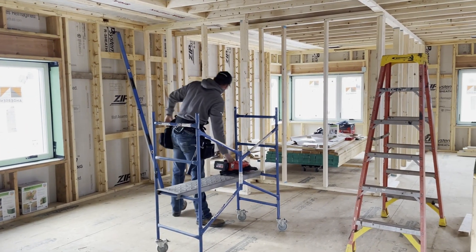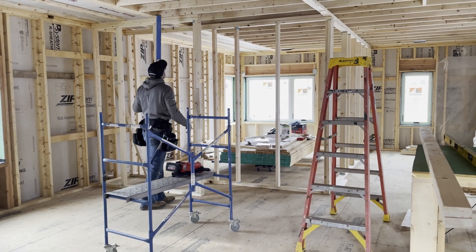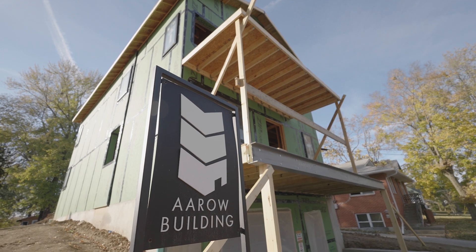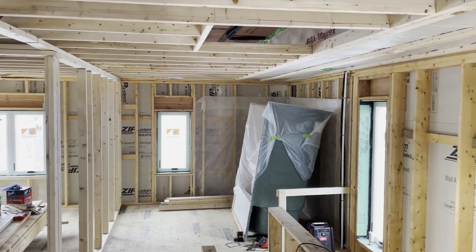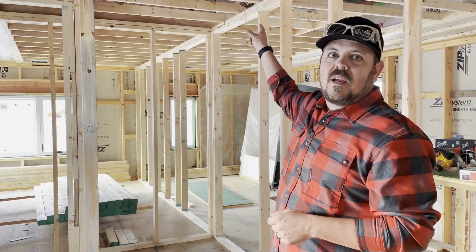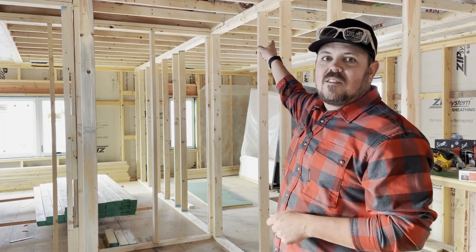So we're switching things up, doing things a little differently, trying new methods. This is the perfect house to try little things like that on because it's only 1,700 square feet over three floors — tiny. Now we're going back in to infill frame all these walls. The HVAC guys got in before we started the two-by-four ceiling. Now we punch in the rest of the walls for the electrician and plumber. The plumber will have one penetration for a vent, and one set of line sets has to go through the air barrier. Otherwise, all the electrical and HVAC happen underneath it — a whole lot less poking holes. By limiting holes, you limit possible problems.